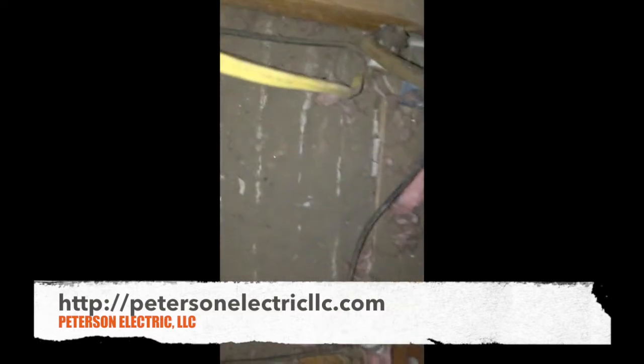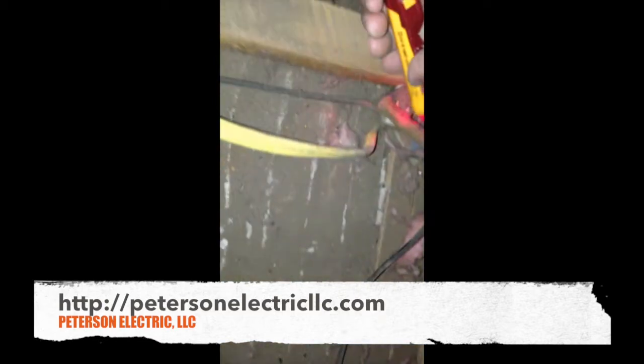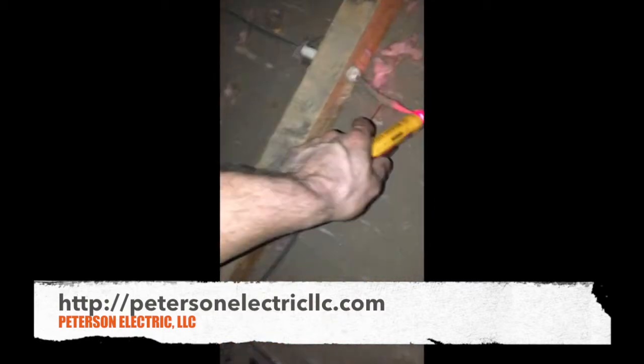Right here comes over — this is a wonderful splice. This one was right over the closet — constant hot. Still not figured out what they're doing here, but looks like two hots in and two hots out. And this is my hot in from the knob and tube — that's what's feeding it. So if this comes in and splices into the neutrals, see how my neutrals are back-fed now? Looks like two 120s — it's not. Remember, that was the neutral, not picking up anything. That's what's so scary about knob and tube.